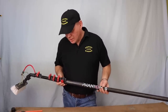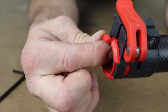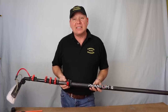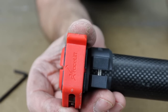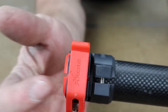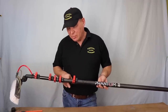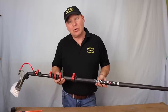The next thing you notice about the clamp is the insert. Inside there's a little red insert, and this is made out of quite a soft plastic. The idea is that the insert will wear and not the pole. So when you clamp it up, it will take up any slack or wear in the pole — any discrepancies — and it will wear the plastic rather than the pole. So even if you have got a bit of wear, it will tighten up and still hold really tight without it spinning.